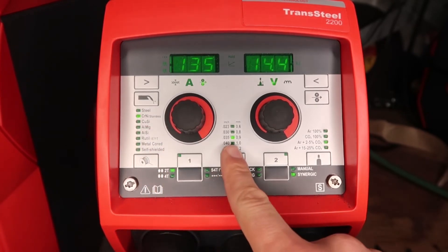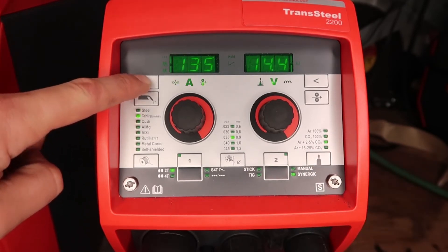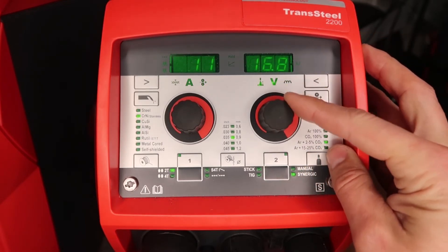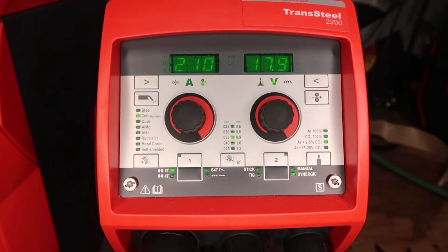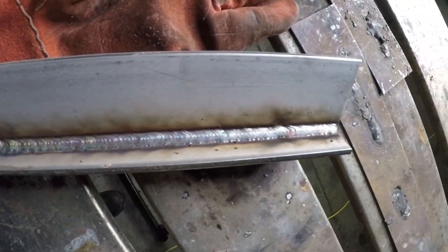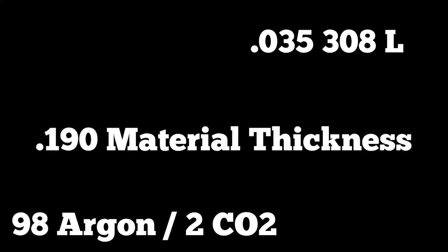Now 308L on 190-thou material thickness but on 110V. Set for stainless steel, 0.035 wire, 98/2 CO2. Wire feed speed around 210 inches per minute at 17.9 volts. On 110V we are in the range of globular/short-circuit transfer, so we're getting quite a bit more spatter — also more than 308LSi since there's no silicon. I'm doing a whip-and-pause motion to get a dime stack effect. We're limited on amperage and volts at 110V, but the weld seam is consistent with some color and a little spatter.